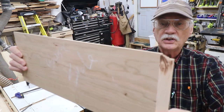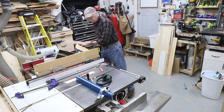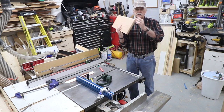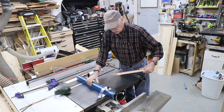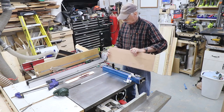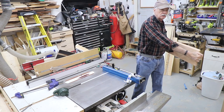And there we go — a little burn that's never going to be seen. So this is going to be on the right side of the cabinet. Now we do the left side. For the left side, I want the miter cut on this end here. The right side I ran with the profile down; for the left side I run it to the saw with the profile in the back, which gives me the 45-degree cut to fit on the left side of the cabinet.